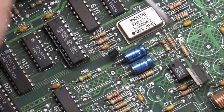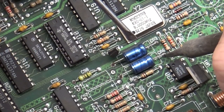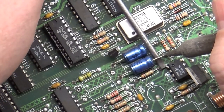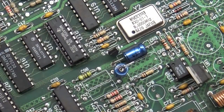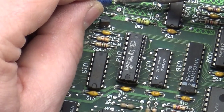Now you want to be careful not to gouge or damage the board, but all you have to do is heat up one leg of the axial cap here until it liquefies. Take your... See that? It just lifts right out of there. It lifted right out. Then you can take the other side, heat it up until it liquefies,